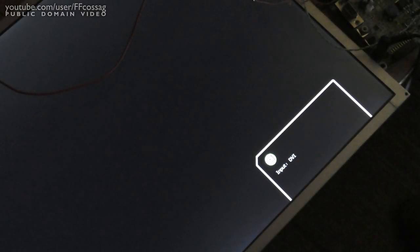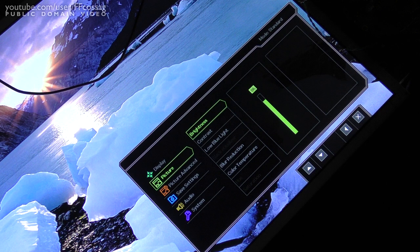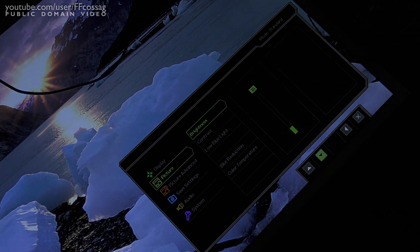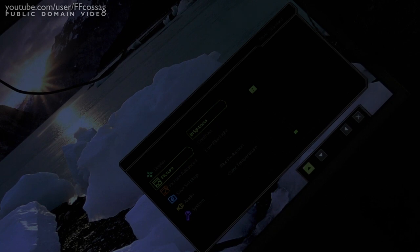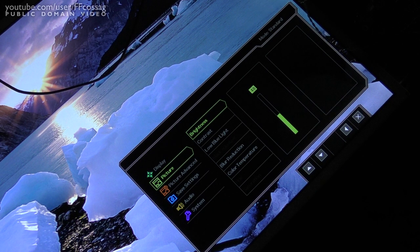As you can see, it's working just fine. My computer just blue-screened — okay. Another thing you need the power supply to do is control the brightness of the monitor, and that was a bit of a bother to get working since the BenQ uses a very fast 18kHz PWM output to achieve this for the original power supply. I got it working through some analog magic, and that is where we see one of the gained features — not only can I dim the backlight down extremely low, but I can actually dim it down until it disables completely. That is not a feature you get on the original monitor, since it's very risky: if you turn it down too far, you'd have to navigate a menu without a backlight.